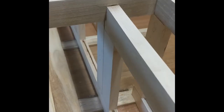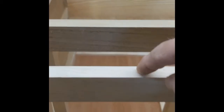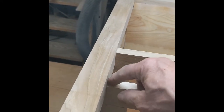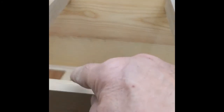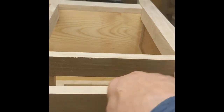The web frames here - there are 16 pieces total; there are a lot of moving parts in this seemingly small construction. Those are all made out of three-quarter-inch hard maple. These ones here are recessed because there are going to be two drawers here where the fronts will be essentially flush with each other - there'll be no horizontal rail panel as there will be elsewhere. So we'll have two drawers here, one here, and then two more over here. Those will all be hand-cut half-blind dovetails in bird's eye maple fronts.